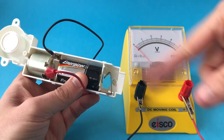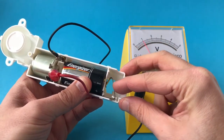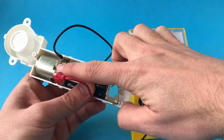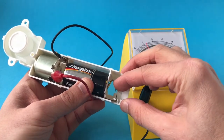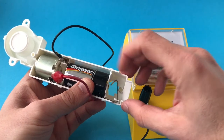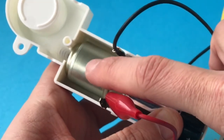I'm going to take my voltmeter and connect it up to the two pinpoints on the motor. That way I can tell — when I connect this up the needle on my voltmeter moves and goes to 1.5 volts, which means the motor itself is getting the necessary electricity it needs. It's not that there is a corrosion problem on the metal stopping electricity from getting through the circuit from the battery. So that proves the connections are working, but it's the actual motor itself that is the problem.